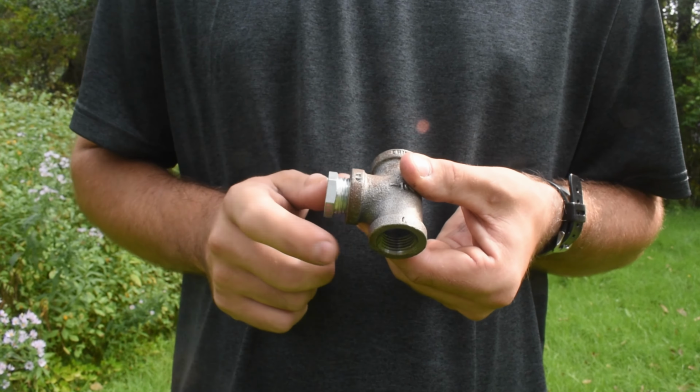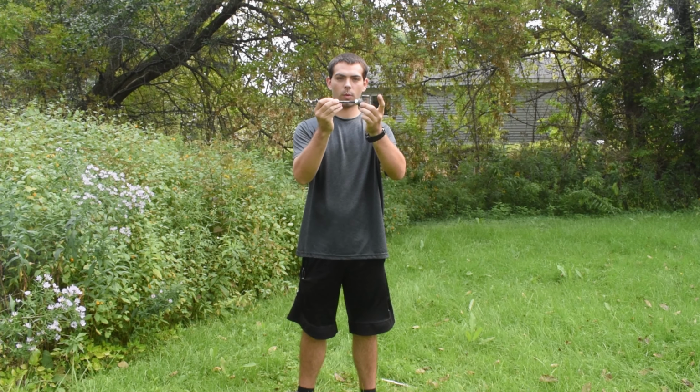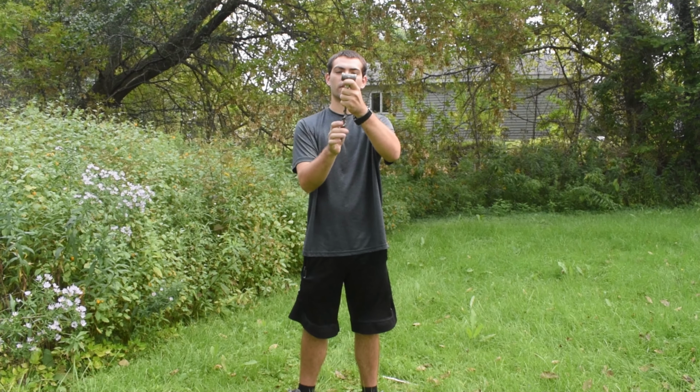So now that you know what we're working with, now we're gonna need our auger bit. So for this project, and I'll show you this up close, the auger bit is going to go inside of here when we heat this up. And it's actually gonna forge to this square end that they have here. And what that's gonna allow you to do is, instead of carrying something big like this out in the woods, you can carry something little like this, and then you go cut a stick. You put a stick through here, and now you have a long handle to use your auger kit.